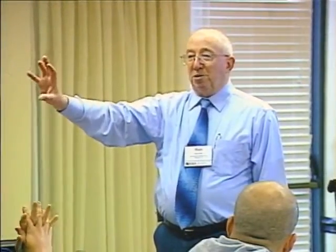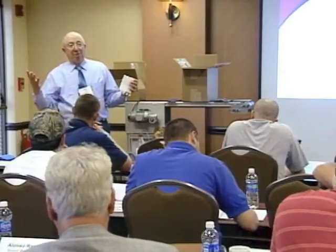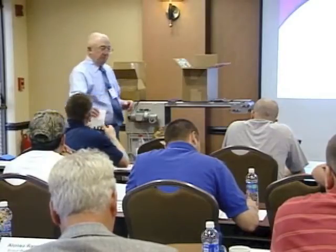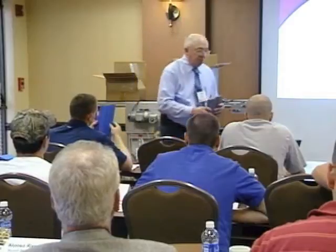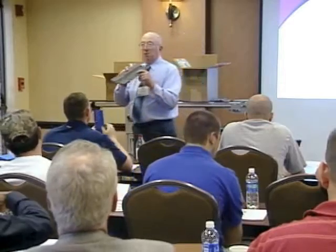If you order a 36-inch wide belt in polypropylene, the actual width is going to be 35 5/8. It depends on the manufacturers, because the manufacturer's tooling is done differently. This becomes critical if you're putting a modular belt into a pan, that you don't have it messed up, because the pan is only so wide. You best not try and put a too wide a modular belt in that, or it won't fit. So those are the differences as far as pitch variations are concerned. And come back to sprockets in a minute. Let's talk about some of the other variations you can get.